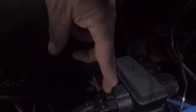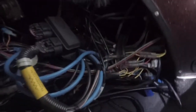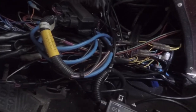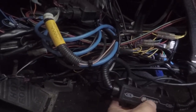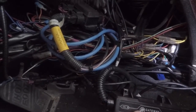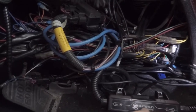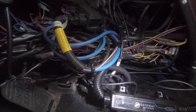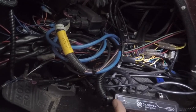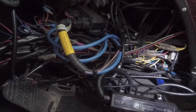Let me back up. This blue cable is coming from the motor right there, and then it goes out to the SmartCraft, into the ignition switch. This cable then goes to the gateway. The gateway brings in CAN bus information — it's unclear to me if that's OBD information or proprietary Mercury — but it's basically the motor information and data coming in here, creating a gateway.